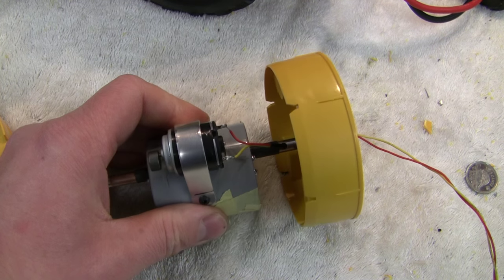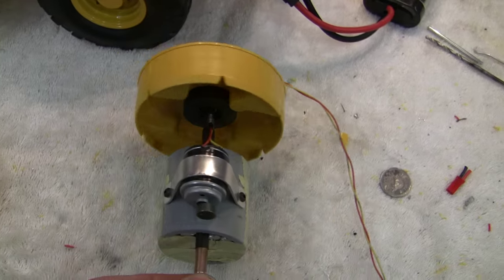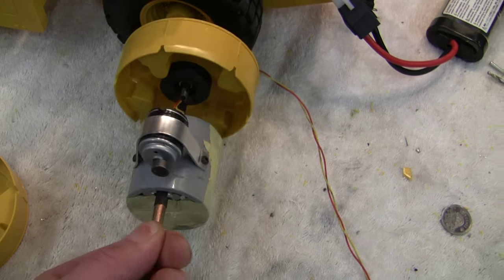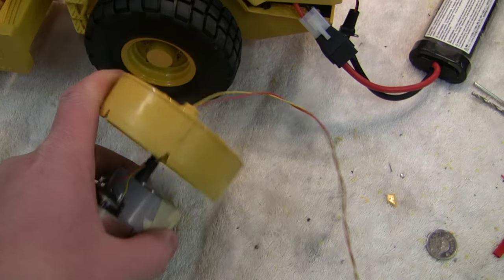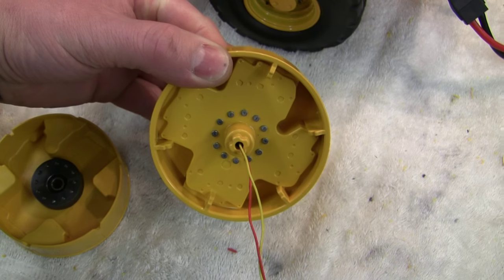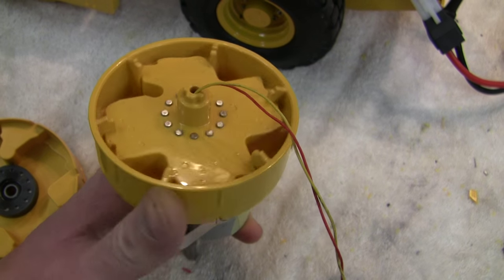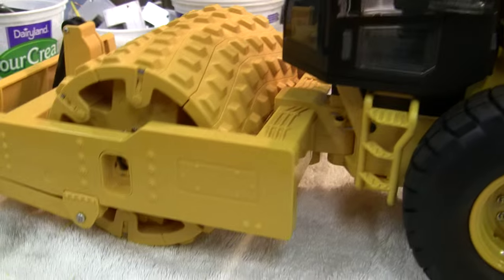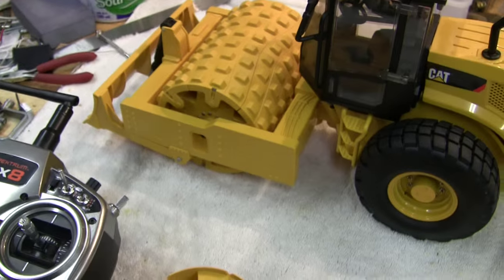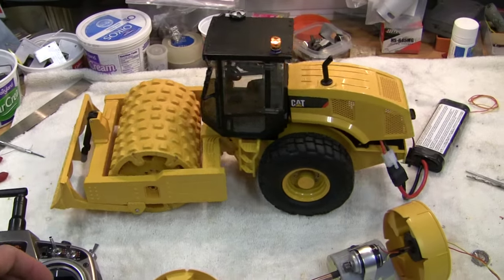The motor goes on it so it's a little bit heavier than that, but the good part is it wheels around and just hangs there, so you're not actually trying to roll this mass or push extra weight on the machine — you're not actually trying to turn this as the machine rolls, so it should help with how it steers. I drilled out the existing little factory divots and put some 2-56 stainless bolts in. Wire runs through there and I slipped a piece of heat shrink on it, so there shouldn't be any issues with chafing.